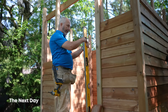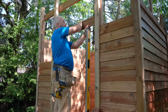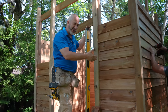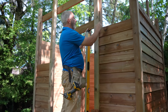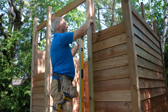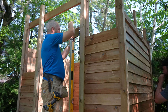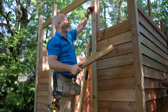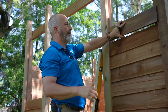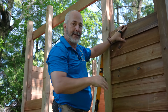From the beginning, the plan is to have a six-foot door — which is this height — plus an extra board at the bottom, which gets the door to finish off at 78 inches, which is minimum code. That's about two inches higher than my actual finish point here. So I'm going to put on this board, then this one, then one more — three more boards to set the front height so we can create a slope. Then we finalize the boards and make all the adjustments to the posts for our roof.